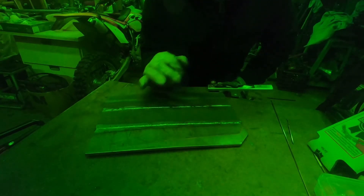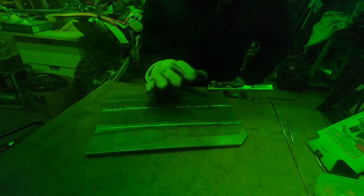That's the drawback with scratch start - you've got to pull it away, break the arc, and bring it back down to shield the end. If you don't pull away far enough you get that long arc and it'll kind of pit it.